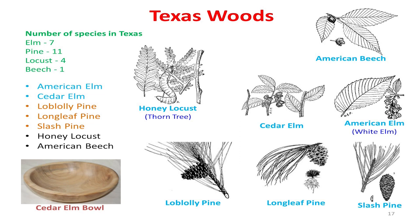The box elder red, if you expose it to sunlight or air, the red goes away or turns brown — it's not pretty. The only way to keep the red is to cut it, make your bowl quickly, seal it, and keep it out of sunlight. If it's going to get any sunlight, put marine varnish on it for UV protection.